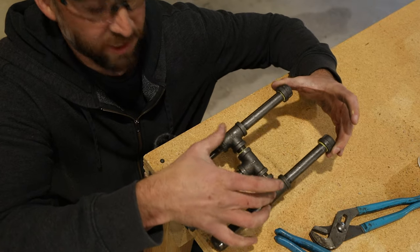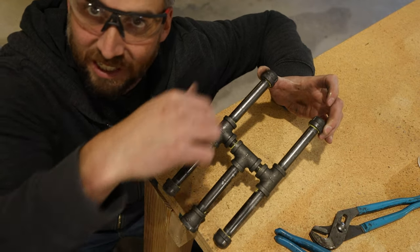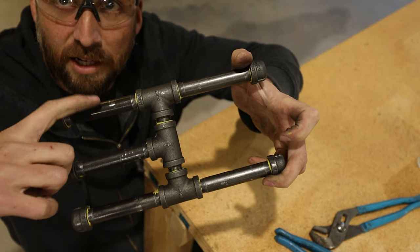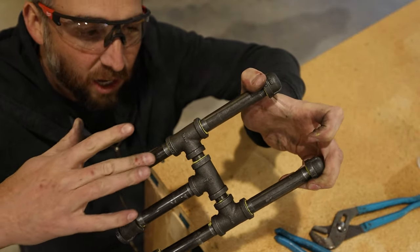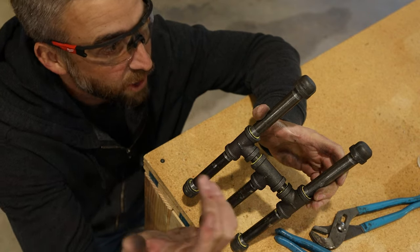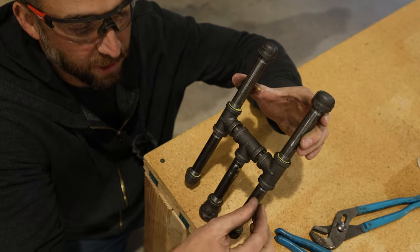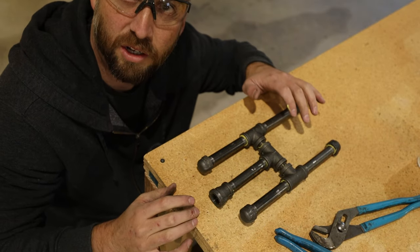Make sure when screwing this together that the two bits are close enough to fit in the ammo can — I had to put it in my vice to get a couple extra turns. So: half-inch to three-eighths reducer, four-inch sleeve to a T, two close fittings to another T, then four more four-inch pipes with end caps. We're going to grind a flat spot on each pipe to make it easier to drill holes, then use a 7/64" drill bit — eighth-inch is fine too — and do three holes on each one pointed inward slightly to keep the flame off the walls.